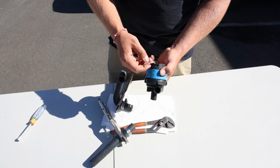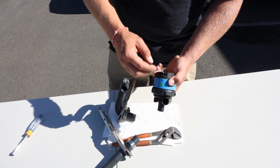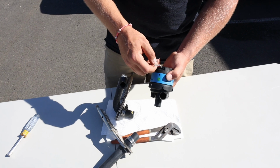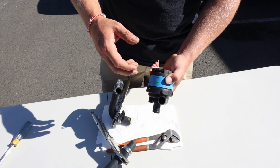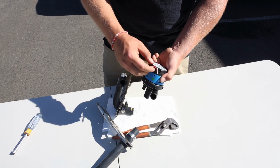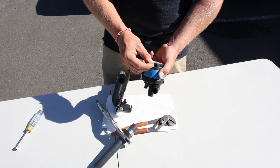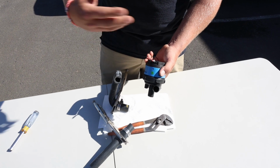In this position, with the white and red tied together, the pump will be at the normal speed. And for instance, if you have to prime the system because it's a very long system or just the way things are, it's hard on the pump to start a prime on the normal speed, you can actually hook this white wire up to the ground. And when you hook it to the ground, it makes the pump run at max output, which is more of a prime speed, allowing the pump to prime the system, pushing fluid through everything.